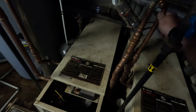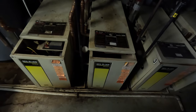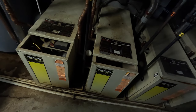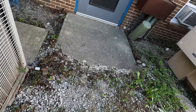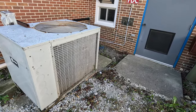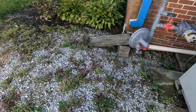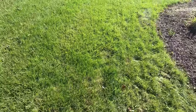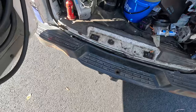I'd like to see it starting to get warmer going out - this one's working too, and then this one's just getting ready to kick on. This one here has got a draft motor issue going out, but you might be able to get away with just three of them. They have a thermostat on each room. So what we did is shut that one boiler off with the draft motor issue and run the other three that are firing off fine. They don't want to do anything just yet - they bought the building about eight months ago and are already replacing some package units on the roof. This system goes to air handlers in each room; when the thermostat calls for heat or cooling it turns on the fan and blows air through the coil - either hot water or cold water. None of it's treated, which is pretty bad.